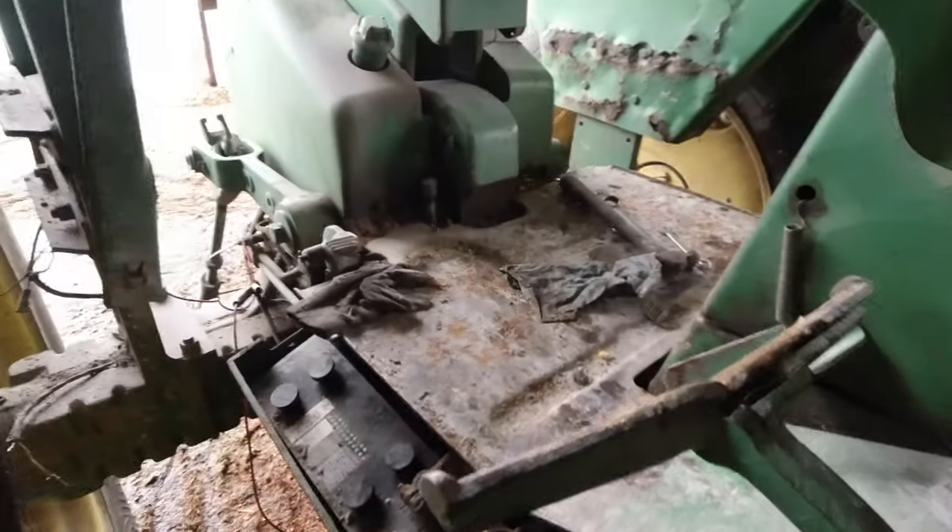That's what happened with our skid loader — I didn't let it warm up long enough, and by the time I made it to where we were working, the engine hadn't had oil for such a long period of time. It started knocking, we started having metal on metal, and that's why it's in the shop now — we're taking the motor out because the motor's gone bad. That can be a very expensive fix, whether on a tractor, skid loader, car, whatever. Engines aren't cheap.